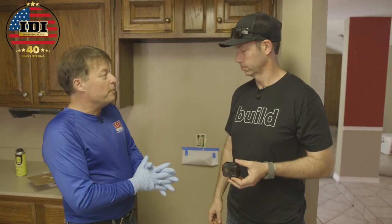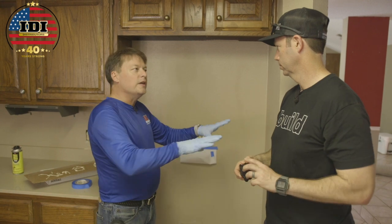There are 58 of these outlets on the main floor. Sealing every outlet on this floor isn't going to change your energy picture by even 2%. But when you think of the stack effect — energy flowing up and out the top of the building, drawing in dust at the bottom — sealing these outlets moves up the scale of importance very rapidly when it comes to less dust and better indoor air quality.